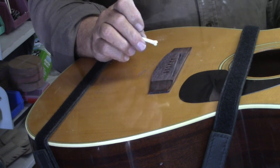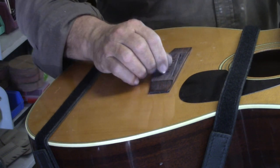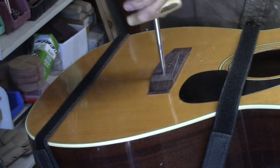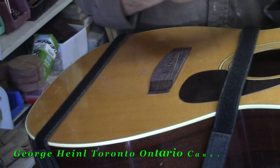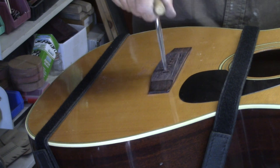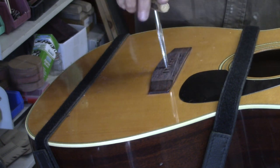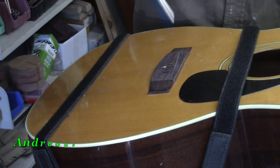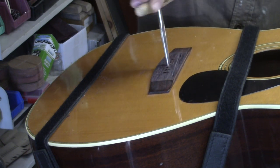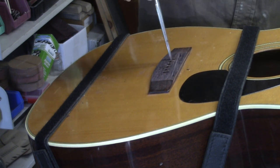I've got those original pins, and I'm going to get the proper reamer to ream those holes out, because the pins are going to sit too high now that we've thinned out the bridge. With the reamers you want to go just a couple of strokes at a time — don't get too rambunctious with it. These reamers I got from George Heinle in Toronto, the violin guy. He's been supplying Canadian luthiers with reamers, luthier's knives, nuts, saddles, cases, bridges, and all kinds of things. Good people — you can give Andreas a call, he'll take care of you. They supplied me with all the classroom files, nuts, saddles, and files when I was teaching college courses for a good ten years.